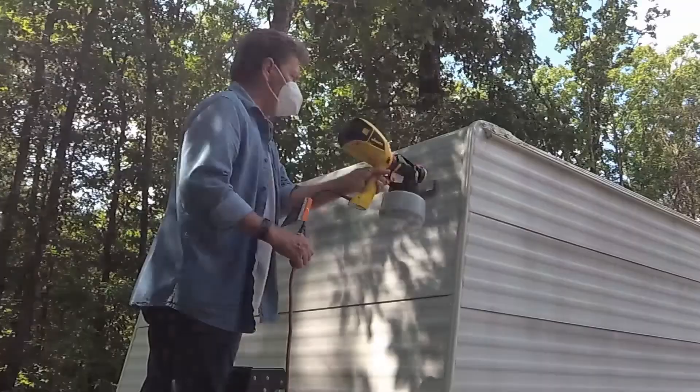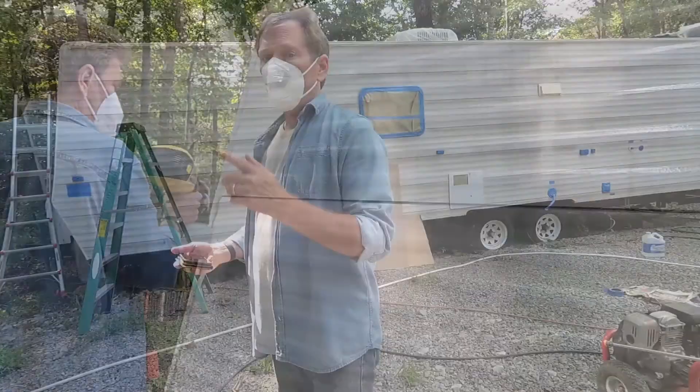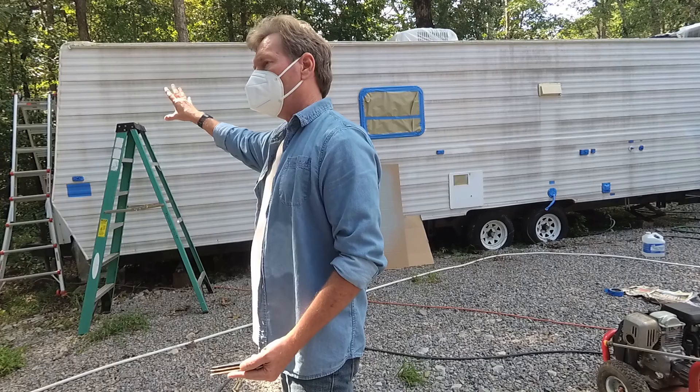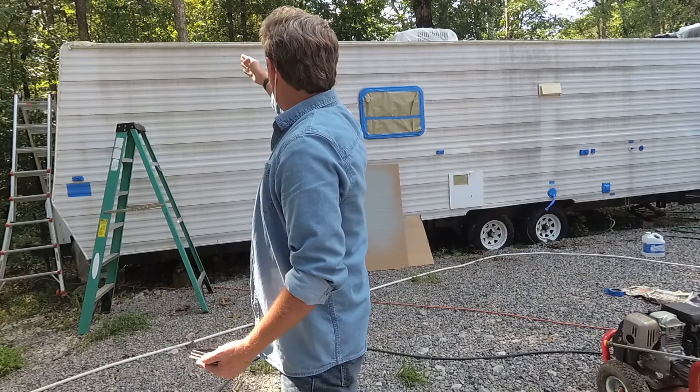The main thing I noticed with this gun is that it's really quite heavy — like holding a gallon of milk in front of you. The main thing we need to do when spraying is what's called keeping a wet edge. On the front I kind of messed up because I thought I could get it all the way across. You really don't want to come back and fill in between two passes because if the paint is starting to dry you might get a cloudy edge. So you work your reach down as far as you can go, move the ladder, and pick it up again.